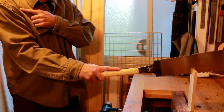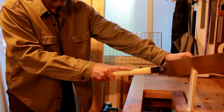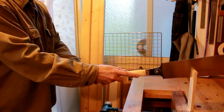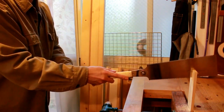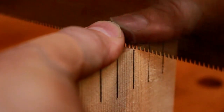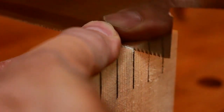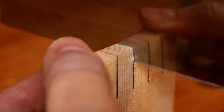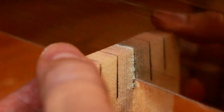A Japanese saw works the same way. You want to make sure that your wrist is in line with your elbow and your shoulder. I put my index finger over the top of the handle to keep it straight. If you want to use a two-handed grip, that works well too — keep the handle in the center of your body lined up with your belly button, then pull evenly with both arms for a full clean stroke. Use your thumb against the blade to keep it at a perpendicular angle, then pull with full clean smooth strokes and let the teeth do the work.